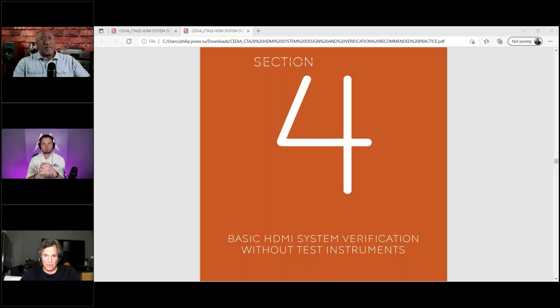So this was the old cable. They changed the projector. They changed the source. They left the same cable in the ceiling. It seems like minor problems, but this is a three or four month old issue that was huge. I hooked up those two devices and plugged it in, and there was no HDR available on the format analyzer. I'm sending it HDR out of the generator, reading what's going down the cable, and it doesn't get through the cable.